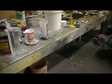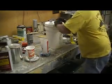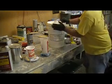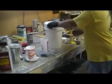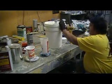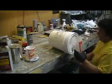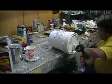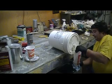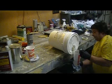I got to mix me some more resin and get some more in my resin cup. Check out this — this is just my Associated Industries 2108 clear resin. 25% hardener, that's 4 to 1. Now I went through a lot of resin the past couple of years, and this is how it works best for me. I take my resin and pour it in a cup — just leave the lid on it, then sideways and bam! Then I can pour more exact measurements in my cup rather than using the 5-gallon pail.